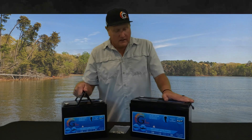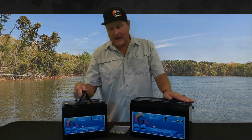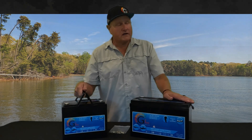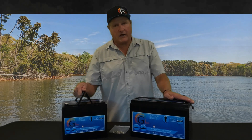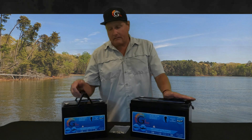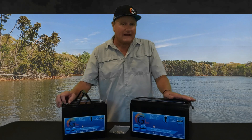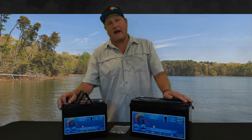First, why we developed them. There's a reason that consumers, technicians, and manufacturers have been hesitant to recommend lithium batteries — it's because they have low resistance. The problem is the communication between the outboard and the battery due to the low resistance of a lithium battery. When a lithium battery gets fully charged, it has little to no resistance. So as you're rolling down the lake, some motors tend to over-volt and over-amp these lithium batteries because the battery is fully charged but still has low resistance — the motor is trying to pump it full of amps and voltage. That doesn't happen with lead acid or AGM, because when those get fully charged they start to build resistance and the motor won't do it, so you never get that runaway voltage.